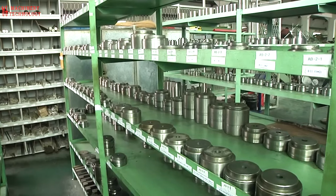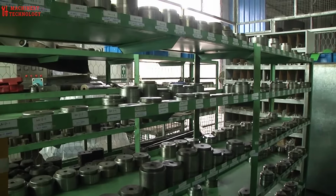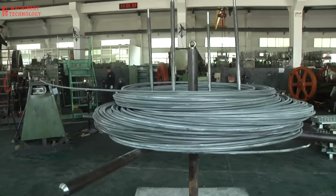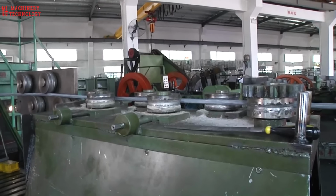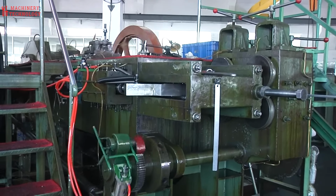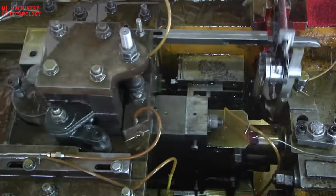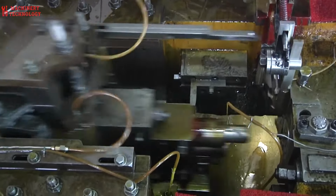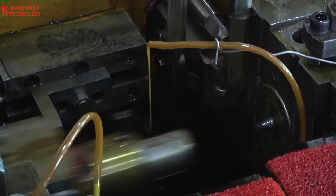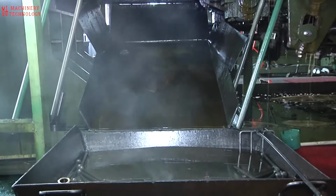Compared to hot forging, cold forging offers manufacturers several distinct advantages. First, it eliminates the need for heating the metal, saving on energy costs and production time. This process also yields parts with superior consistency and interchangeability. Additionally, cold forging results in a better surface finish with minimal contamination, reducing the need for post-processing. Tight dimensional control is another benefit, ensuring parts conform to exact specifications. Cold forging even has the ability to influence the grain structure of the metal, creating parts with directional strength properties.